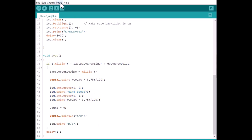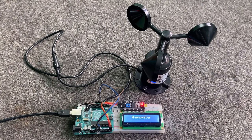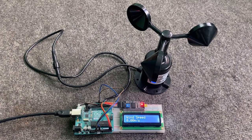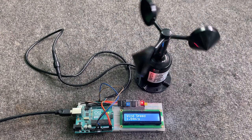From the Tools menu, select the Arduino Uno board, then select the COM port and upload the code. After uploading the code and powering up the entire device, the LCD will display the wind speed at zero. This is because the cups are not moving and there is no rotation. The speed will change as the cups of the anemometer start moving.